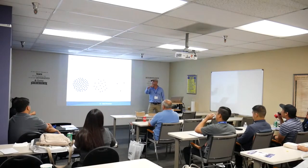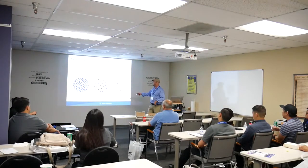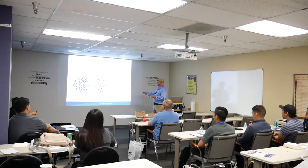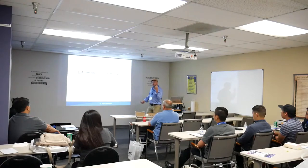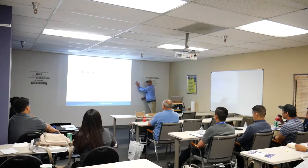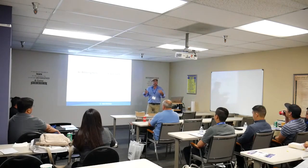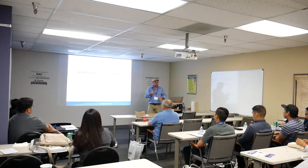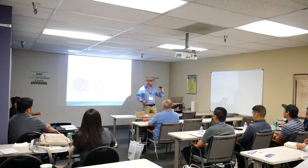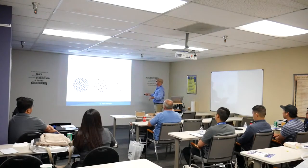There are levels of vacuum. With no vacuum, an atom can barely move. With semi-good vacuum, it goes a little further. With really good vacuum, it can travel from one side to the other — or miles further. In atmosphere, the number one contaminant is water moisture. Under vacuum, lowering the vapor pressure causes water to de-sorb and boil off, leaving a very clean surface for angstrom-level deposition.